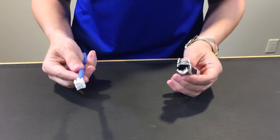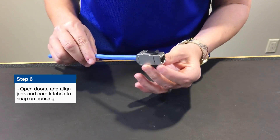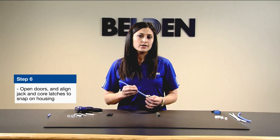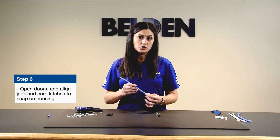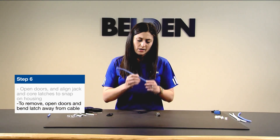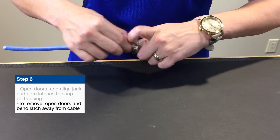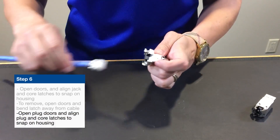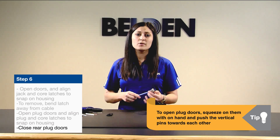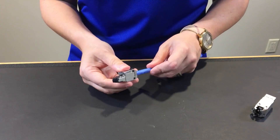From here, you choose: is it an RJ45 jack? Snap it right in and close the rear door. The rear doors are outfitted with grounding clips that allow for a 360-degree bond around the drain wire you wrapped. If you want it to be an RJ45 plug, open the rear doors by squeezing them and pushing down on the pins, take your RJ45 plug, snap it in, and close the doors. The same grounding clips on the rear doors of the shielded plug form a 360-degree bond.